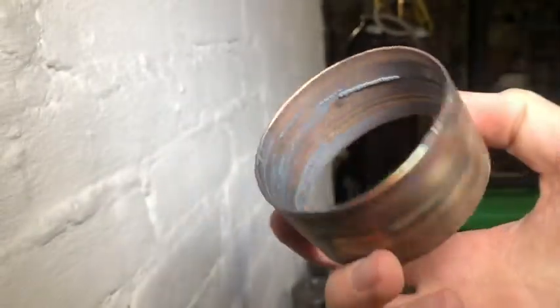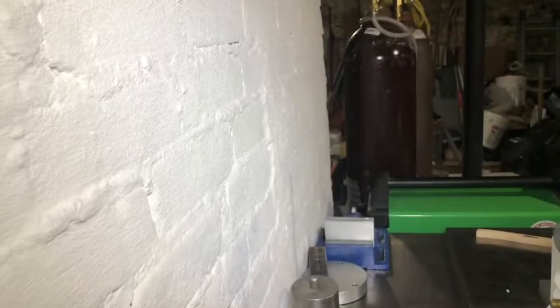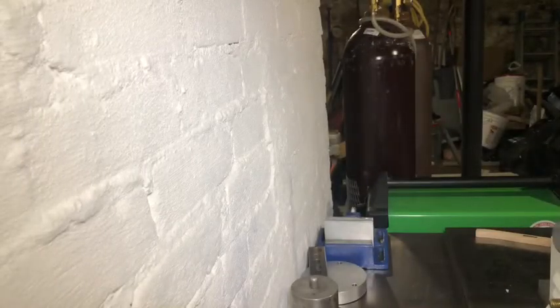I also did some aluminum parts. As you can see, you get pretty much full penetration even on the pulse. I made these for a local. I'm going to put super clean welds on all bungs, basically — these are just outside corners. And then do the same thing on these stainless pieces, roll the V-bands on them.